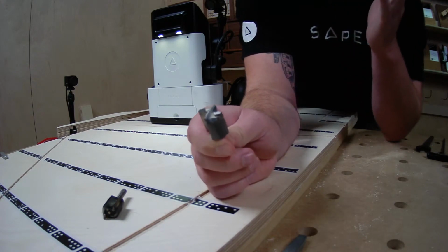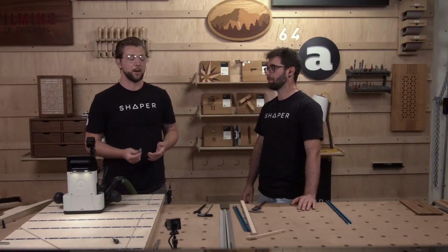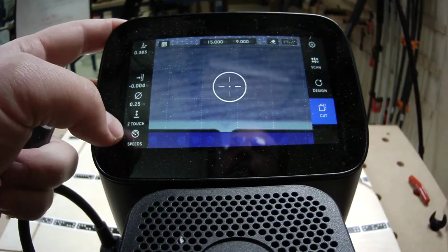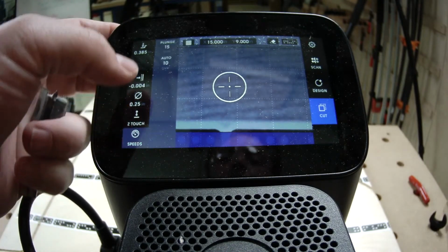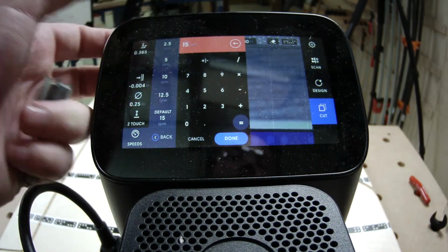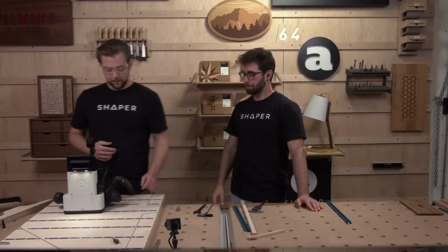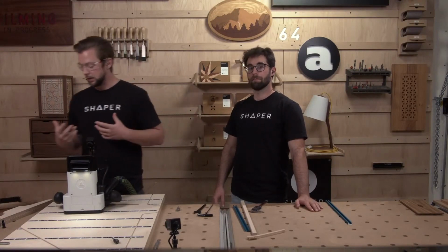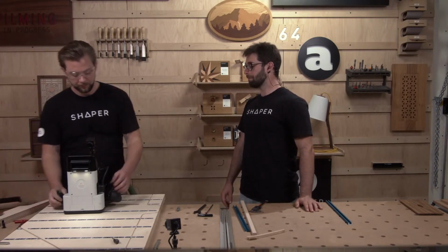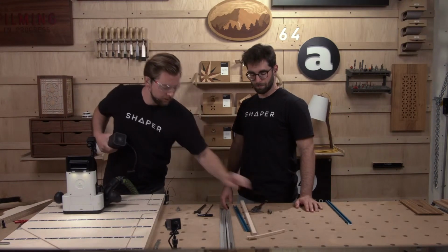Plunge with caution. It's still a large bit plunging into material, so if you want to err on the side of caution, bump down your plunge speed, which for quick reference can be accessed right here in speeds on the bottom left, and you can adjust your plunge and auto speed. Maybe bump that down to say 10 or 8 inches per minute. The other thing is my channel is pretty wide, so that's why I'm using a larger bit, just to pocket it out and get rid of that material quickly. I could do this with a 1/4 inch bit, but we'd be here for a little longer.